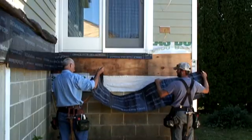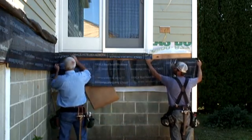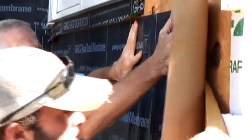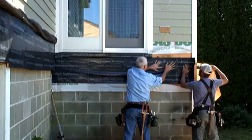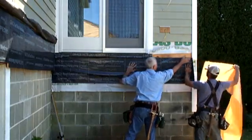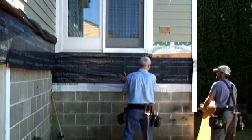I like to use the roofing detail membrane when flashing the wall because it is thicker and has a less aggressive adhesive. Later, when we flash the top of the joist, we'll switch to the decking membrane. You might want to cut that before you... As with any flashing, the top edge of the membrane should lap under any flashing or house wrap above it. After the first layer of flashing is applied, we are ready to locate and install the ledger board.